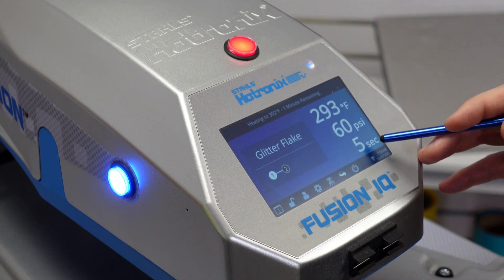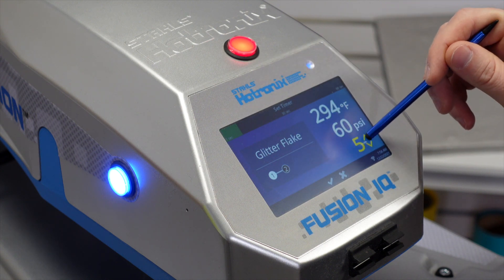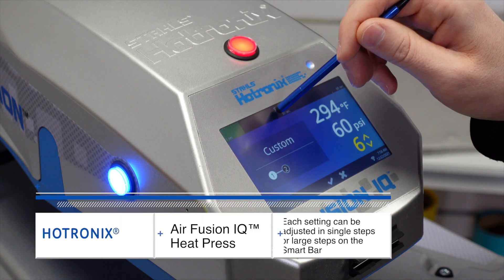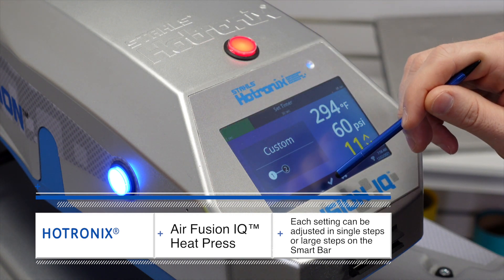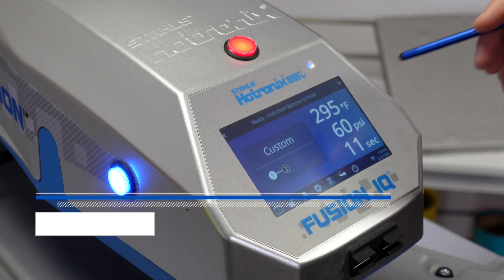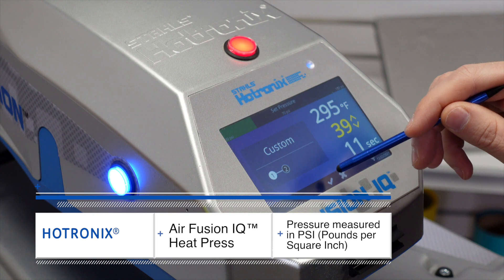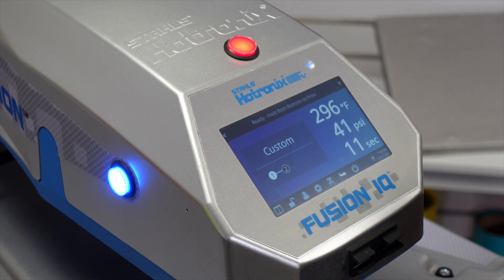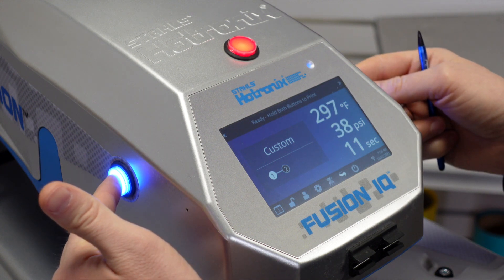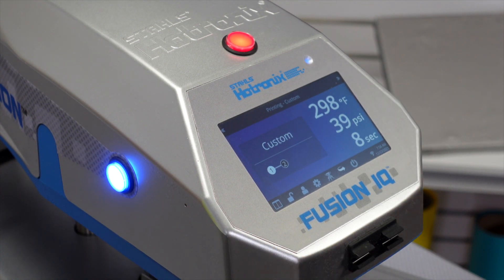The time is very simple — you can adjust it with the touch of a button, in small increments or on the smart bar for larger increments, and hit the check mark to accept the setting. The pressure — all PSI, pounds per square inch — you can adjust in the same manner, quickly adjusting on the fly. This is the only machine on the market that adjusts pressure in this way automatically. When you lock that machine down with the touch of two buttons, you can know that 38 PSI is applying to the item it's coming in contact with.